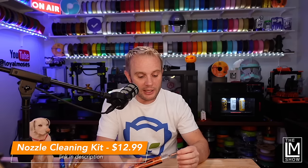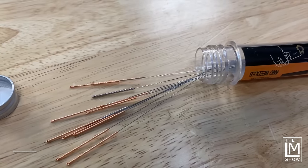Number nine on the list is needles for cleaning nozzles. There's a link in the description for a nozzle cleaning kit — for about $12.99 you get a little set of tweezers and a bunch of nozzle needles. This is a must-have. There's going to be a time when you get a clog and you'll need a needle to clean it out, whether you go in from the bottom or the top. You can also heat those needles up, feed them through the tip of the nozzle, and get plastic flowing. We use them to probe through extruders and check for obstructions. A lot of 3D printers even come with them — I always take those needles and add them to my kit so I always have a bunch of fresh ones.